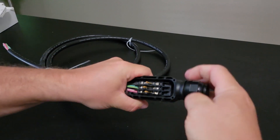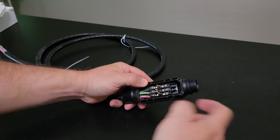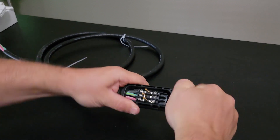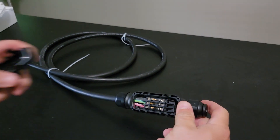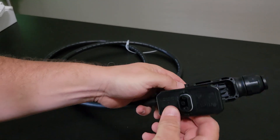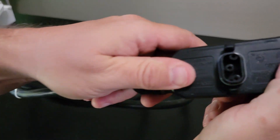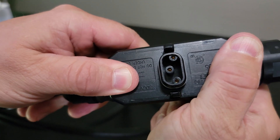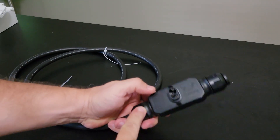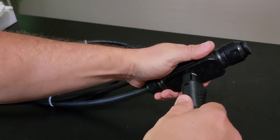This is a cap, so you take the cap off. You would add your next wire into here to extend down to your next microinverter. Or if this is your last microinverter, you can put this in here to cap it off — now that's watertight. Then see those three holes and those plugs right here? You just match those up, slide it in, and you should be able to see it pop in. See those little copper pieces? Now you're in the spot. That's how easy that is to take apart and manage — that's very important. Then you just grab your microinverter and connect in.